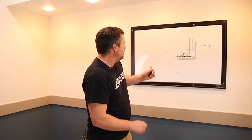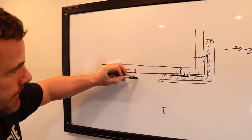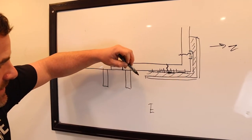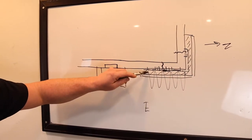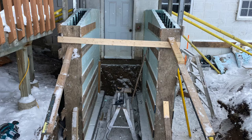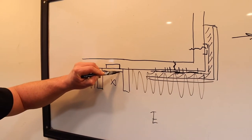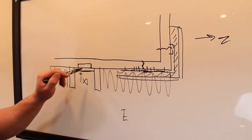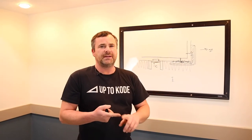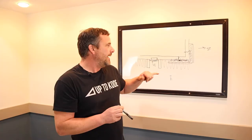Looking at a top-down view: the door is here, with a new retaining wall on each side. The areas alongside the retaining walls will be backfilled, giving frost protection there. But the small chunk between the retaining walls right at the door still needed protection, so before backfilling we added layers of sheet insulation against that section so frost wouldn't drive in and push just that chunk up. Then we backfilled everything level. They also added and repositioned some windows, but we won't get into that.